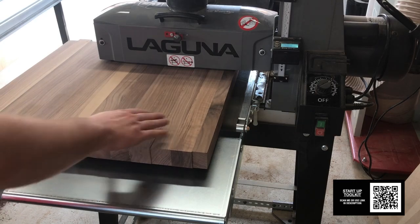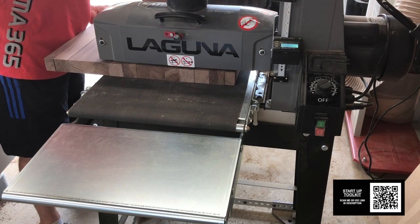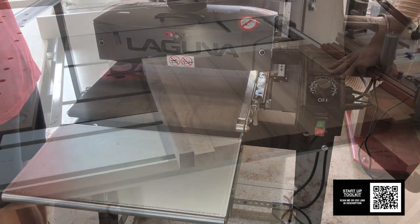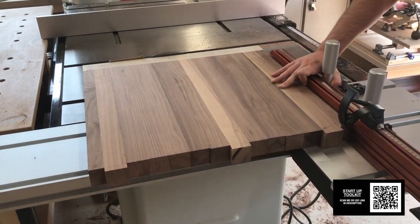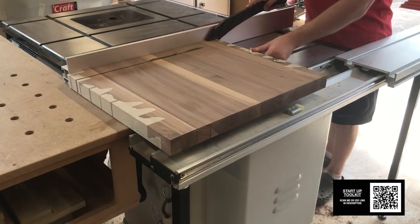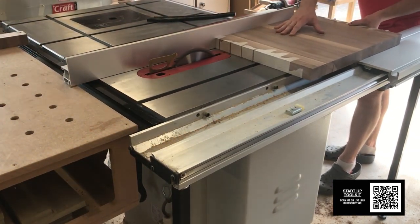Design considerations. By adding the brass feet and elevating the cutting board off the work surface, we are able to negate the need to add routed slots to the side of the board to aid picking up. Instead, the elevated board provides a gap to slide fingers underneath. Also, the elevated board won't sit in moisture. Kitchen worktops get wet and inevitably a cutting board that isn't elevated will sit in and suck up moisture, which is bad for the cutting board and will warp the wood.